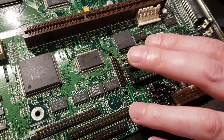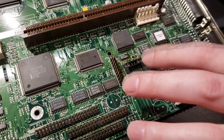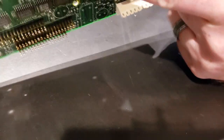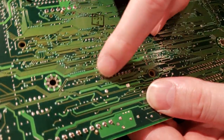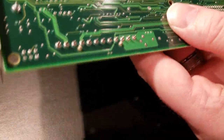Normally I'll take another object, whatever I have sitting on the desk, and just set it underneath the socket and kind of wedge it in between the table and that socket upside down so that it holds it nice and flush with the board, so that when we apply the new solder on the back here, it doesn't get crooked or anything. So I'm gonna pause the camera again, clean this up, and we'll finish this.